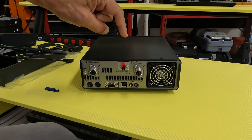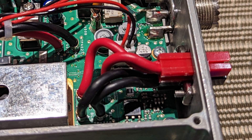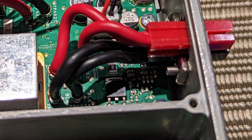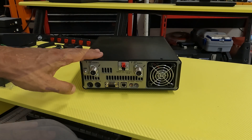I removed the terminal lug from the wire — basically uncrimped the old connector — to keep all the original wire length intact, then crimped them to 45-amp PowerPole terminals and into the connector. Really short wire, really tight to get that crimp with my crimper on the PowerPole connectors. It was tough getting in there, but in the end it did go in.